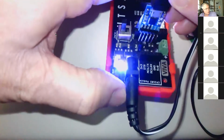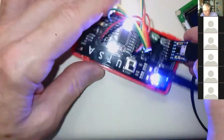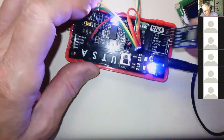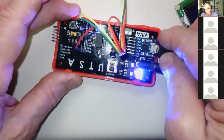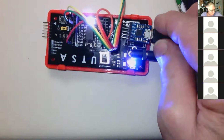And in all fairness, it does look like it should kind of go like this, right? This kind of looks reasonable, but it's not. It goes in like that. The lettering faces the microprocessor. So the back of the board faces out, which just seems kind of backwards. So that's why we've tried to modify most of them so that they plug in like this, where it's really hard to put them in backwards. It doesn't make sense to put them in backwards.